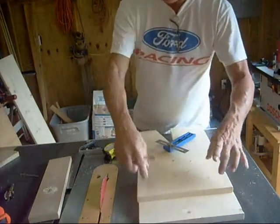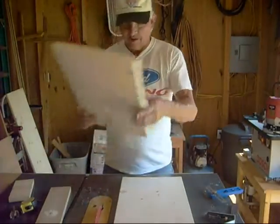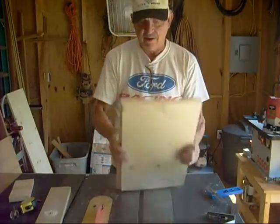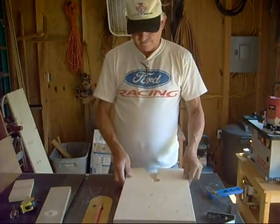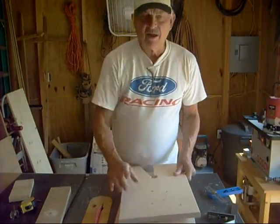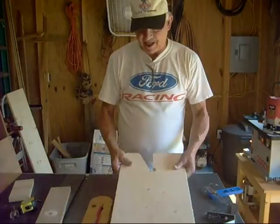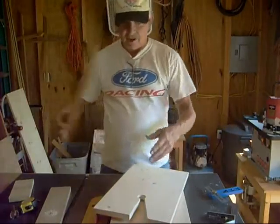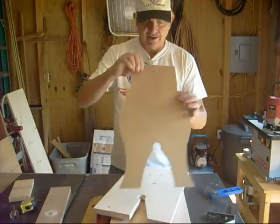Now your skirts, your aprons. 18 inches high. 2 legs. Simple. We're going to have 4-inch aprons, 45 inches long. Got to account for that. We're going to make a leg. Here's what our leg's going to look like. Let's put it that way. That's a finished leg. Template.